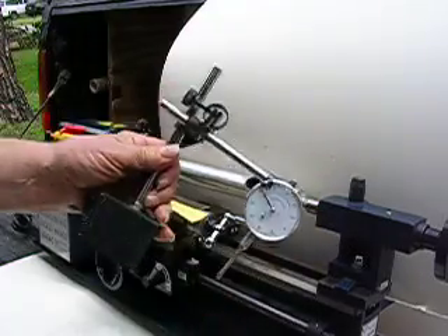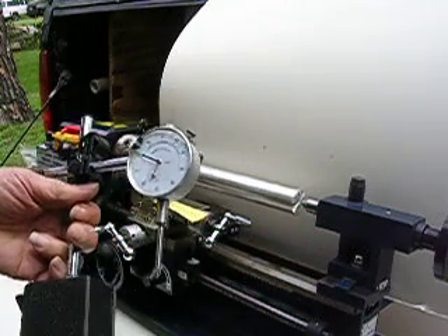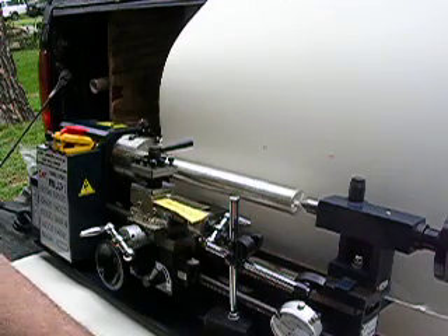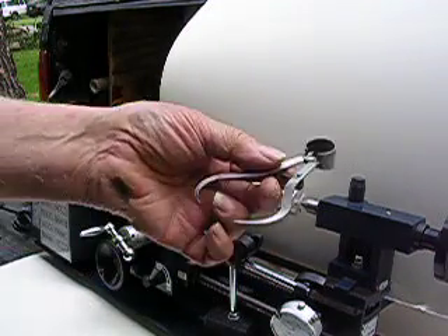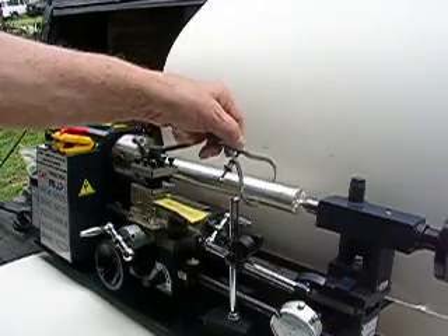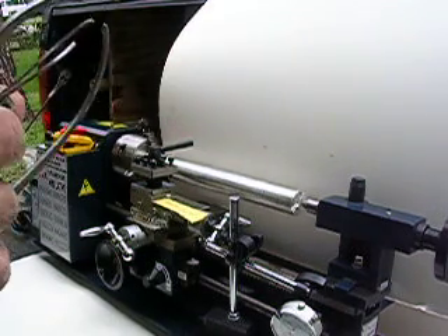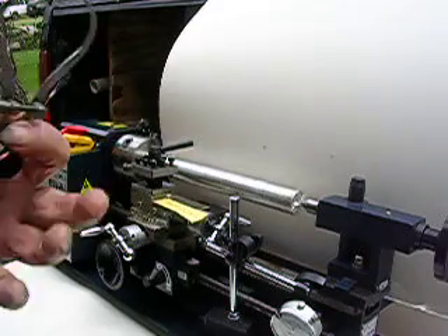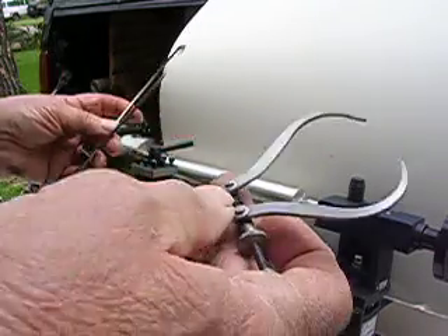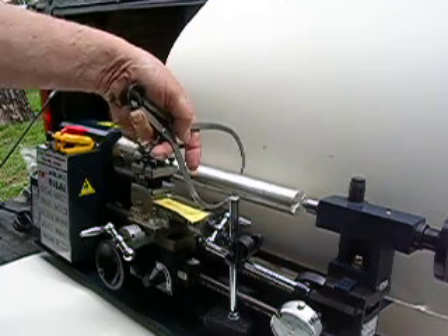A dial indicator — everyone that does any machine work needs one like that. And everyone that does any machine work could use one of these little dividers. That's a four-inch. It'll measure — say you wouldn't cut it down to the edge; you'd set this down on about an inch, then test it every once in a while to see how close you were getting. Then when you got down a little bit closer, you'd use your mic. This is a four-inch, that's a six-inch — it does the same thing. I use one every time I use a lathe.